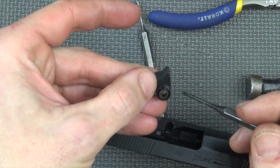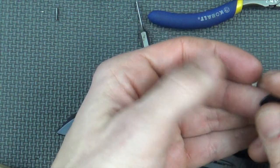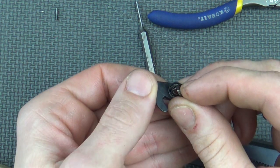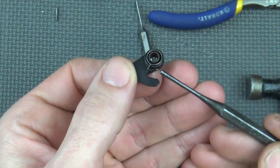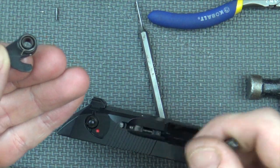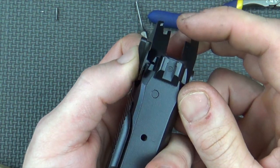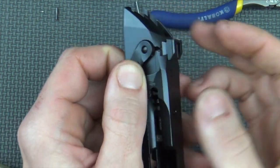This next part can be a little confusing. This little hole you see in your safety — you're going to take your spring and this piece that's sticking up vertically and put that in there. You can see it should drop in there flush. This little piece of spring overhanging is going to go in the groove on the top as we put it in. Make sure your spring is in there, then work it down.